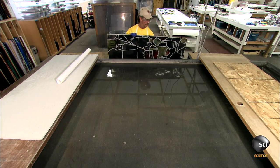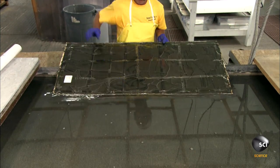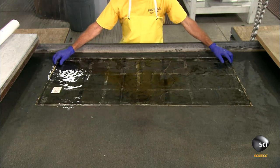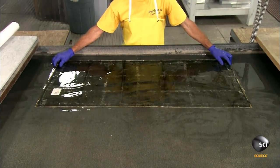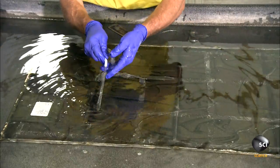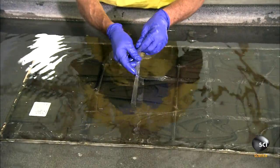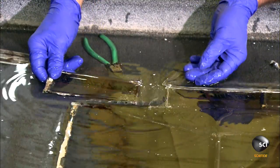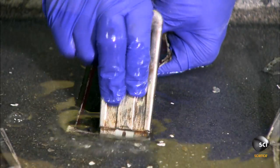After testing the condition of the paint on the panes, he submerges the glass in a non-acidic cleaning solution and leaves it overnight. This softens the glazing cement between the lead strips so the window can be easily disassembled. He then extracts the glass and cleans off the glazing using a straight-edged razor.